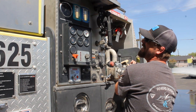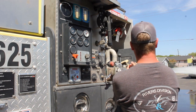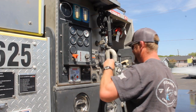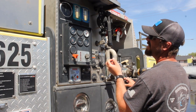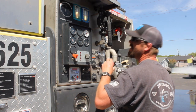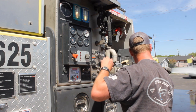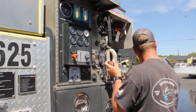So we open the valve until we hit 200. We're blowing more water. Okay, 200, close enough. And we're looking at the flow meter, which is between 60 and 90. And he's going to adjust the RPM and see if he can get the flow to come up. And it doesn't look like it's doing anything. Now it seems like it's just barely dropping down. So back in his sweet spot, 90 minus 2 marks, 1280.